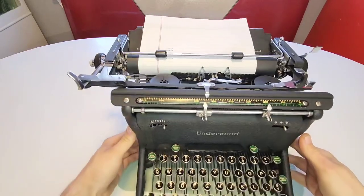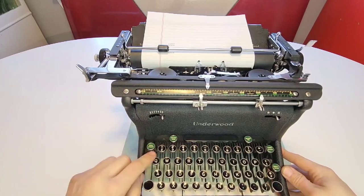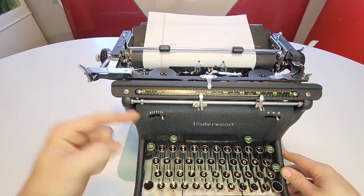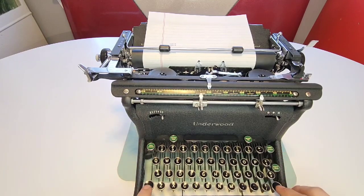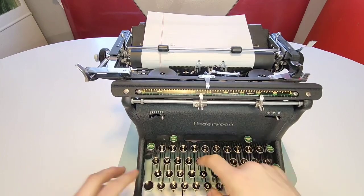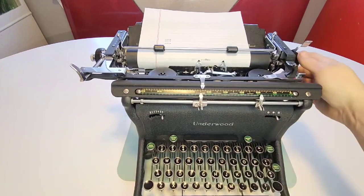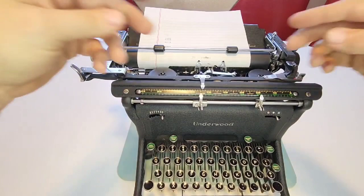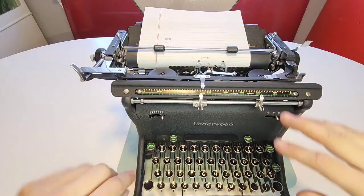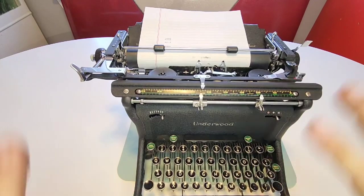Now onto the keyboard. This one actually has a mechanical backspace — as I push it, it goes against the spring to push the key carriage back, which is really cool. Down here are your shift keys — that lifts the entire carriage up, so if I want to type a capital T or a lowercase T, it lets me do that. There's a balanced torsion spring inside that holds the balance of the unit, so you're only pushing the difference of that spring, which works out beautifully.